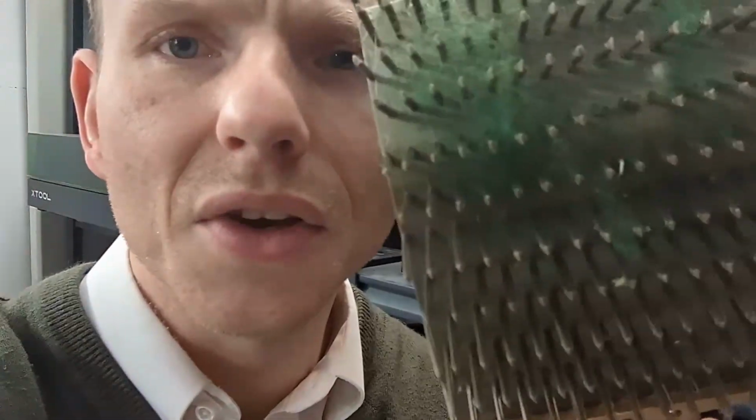And they kind of sort of work, but you'll see that there are some teeth missing there in the middle. Those teeth broke off because plastic is not a great material for this. Steel really would be better. I did not try with some of the better 3D printing plastics for this. I could have used PETG, and that might have improved it. This is PLA, which is known for being a little bit brittle, but it wasn't great, especially if I was going to sell it as a product that someone would use repeatedly. I didn't have confidence that I could make that work.